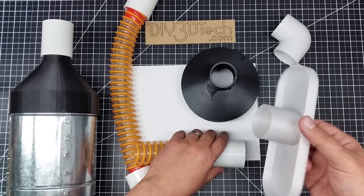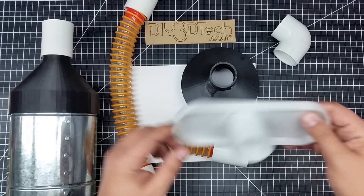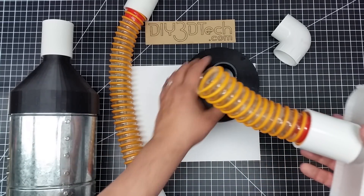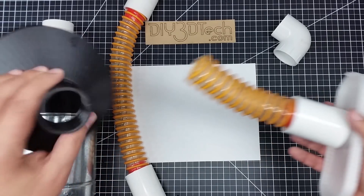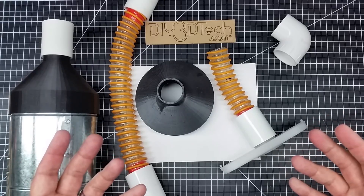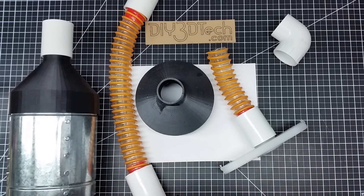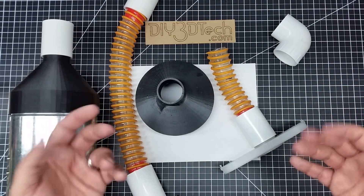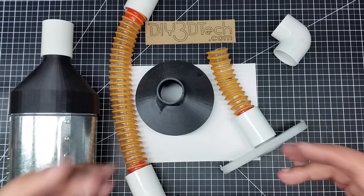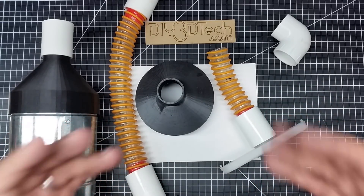I've remixed the side panel for the DaVinci — I'll put overlays up. It pops into the side and you can take the inch-and-a-half fitting, plug it in here, and connect it up to my vent system — something like this — and it actually works pretty well. Even for PLA, I simply use a dropdown tube over the top of the printer, sort of like a little fume hood to draw the air up. I'm far less worried about PLA than I am about ABS or other petroleum-based plastic products.